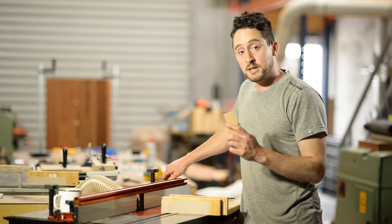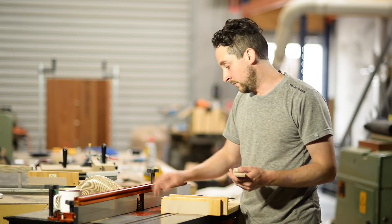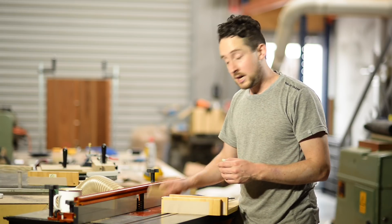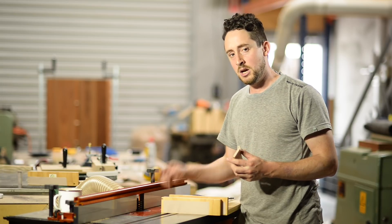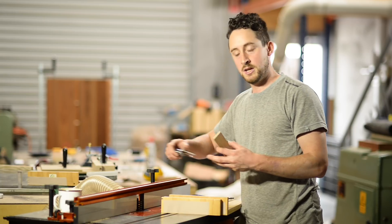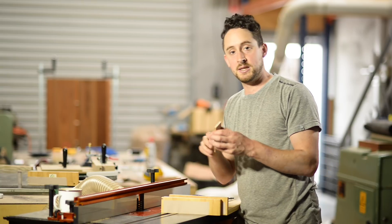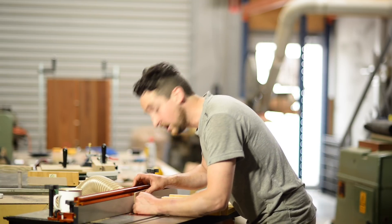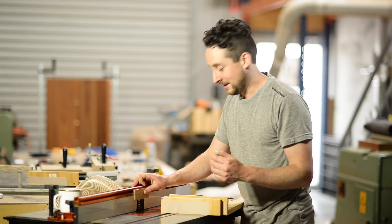Now with these bits, the thickness of your stock is limited by the depth of the bearing set on this cutting head. At the moment I think I could cut stock up to about 10 mil — this stuff is closer to 6 or 7 mil, which was just the style of box I was looking to make. I could make it a few millimetres thicker but this is what I'm working with. If you want to do really wide boards, you're going to have to cut all these box joints by hand.